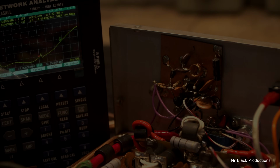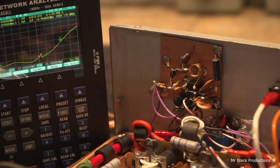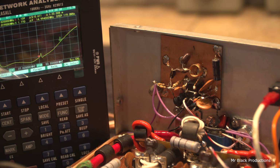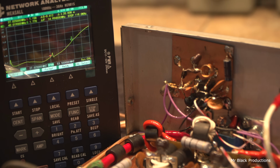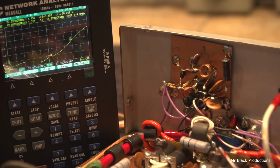Okay, first things first is this coax connector is junk. I couldn't seem to get a good reliable connection with the PL259 connector, so I changed that out. And the other thing I noticed is that this cap was now touching the case, so I moved that, but I couldn't get it quite exactly where I wanted it. It was sitting at like a 1.3, which is still not the greatest, but not the best, and I was shooting for something a little bit higher than that in quality.